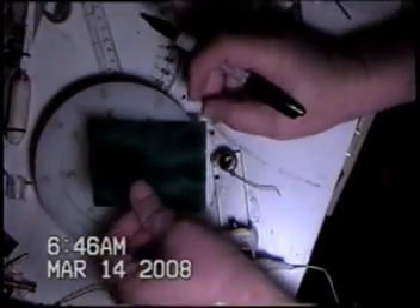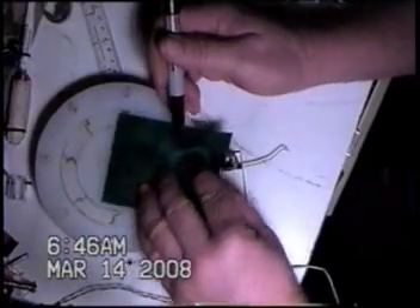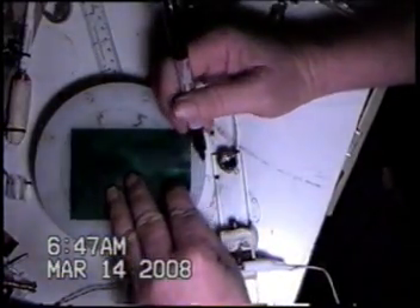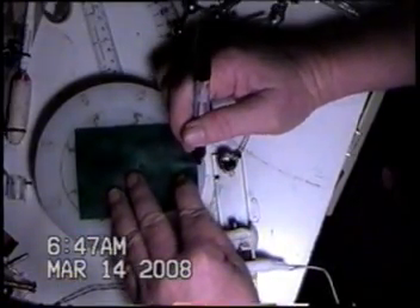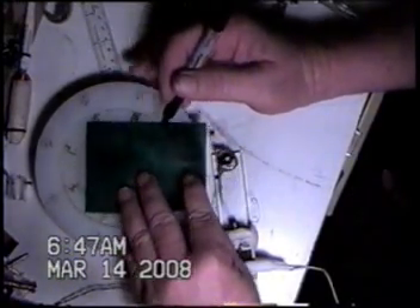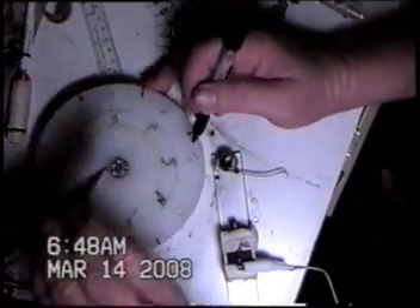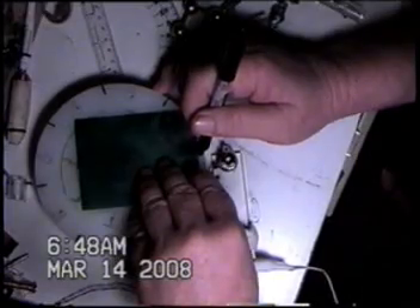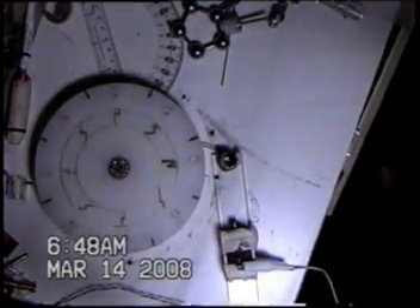You can do the same thing on the rotor here. You can see the equator line right through there — that's the midpoint of the magnets that are embedded in the rotor. So we're going to put a mark right there. That's where our equator is. So those are our equator marks.